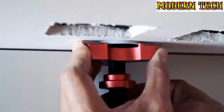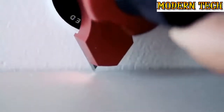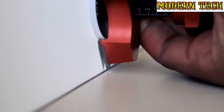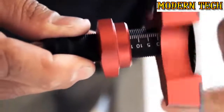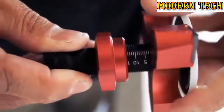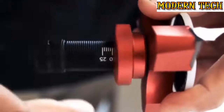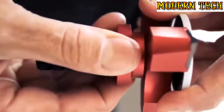Rotate the tool shaft while holding the blade body still until the blade tip touches the edge of the benchtop. You'll note the foot pad cover is fitted. In this instance, four millimeters needs to be removed, so the tool will be set to three millimeters to compensate for the foot pad cover thickness. The lock nut is then tightened to lock the blades at the required height.